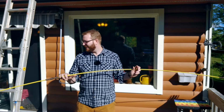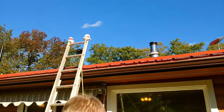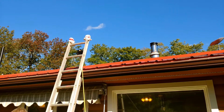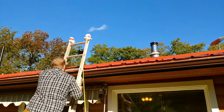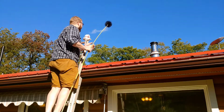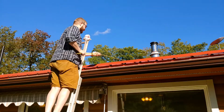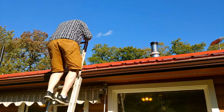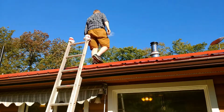And yeah, I'm not looking forward to it. So here's the top tip for avoiding a little bit of arse puckering on a ladder: make sure you have a few rungs above the roof line so that when you get up, you've got something to grab onto and step over on. And you also want to pass your brush up, if you can, so you don't have to carry it up and over. So just get up and you can step over and away you go.